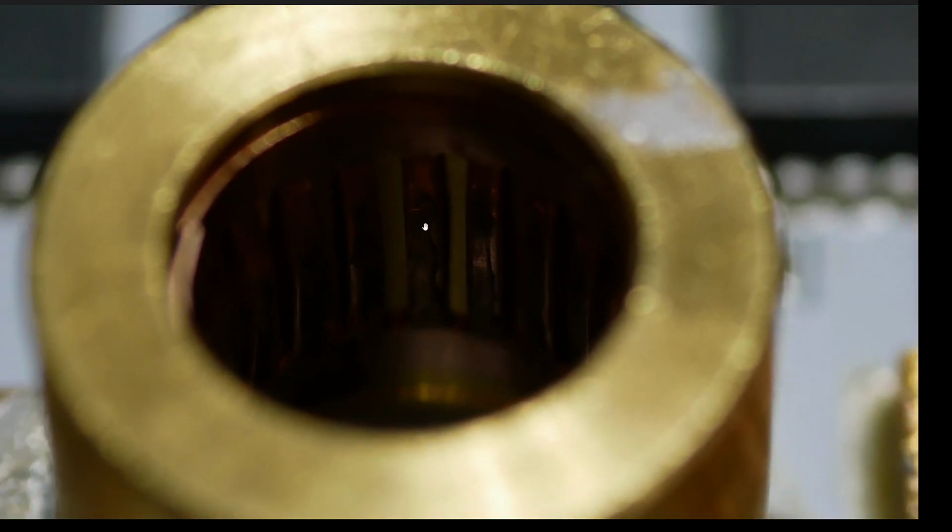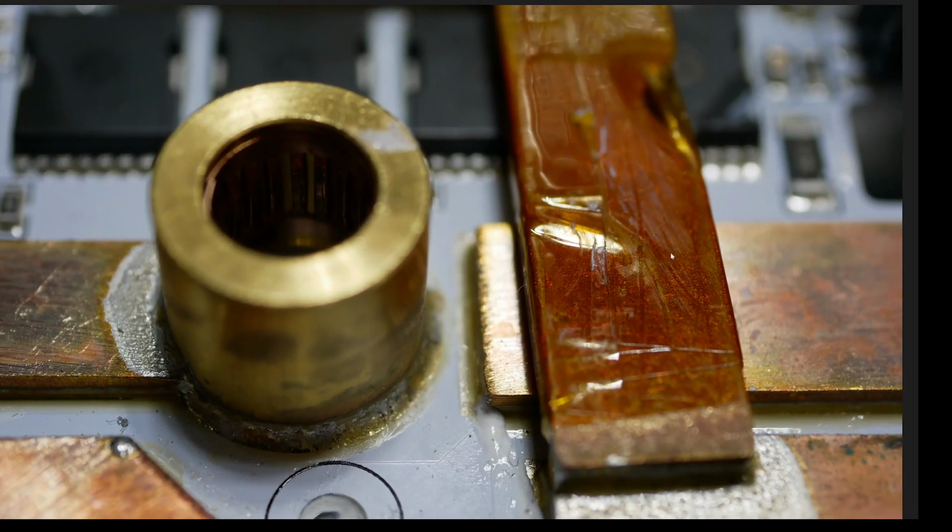Ragged and scorched. So ask yourself for a second, what would possibly cause them to end up looking like that? Because they shouldn't look that way, folks. It's because that connector suffered some massive current spikes. That's how they got that way. That's called arcing and scorching, to make them ragged and rough and blackened like that. This connector saw something really bad happen to it. And now I'm going to zoom out because I'm going to show you what one should look like, or, well, closer to what one should look like, because you can see the difference.